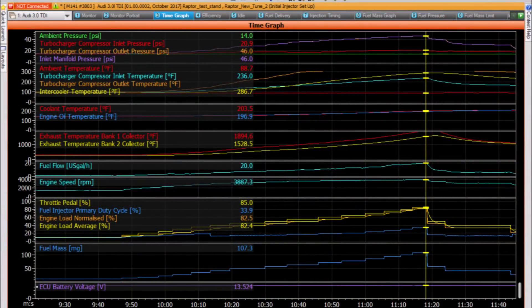On Monday evening I ran the engine again, because the last time I ran it on Friday I realized I didn't have the prop set to the flattest pitch setting — which is what I wanted for that run with the new EGT sensor and the new fan on the intercooler. So I adjusted the prop again on Monday and gave it another run, and this is the result.